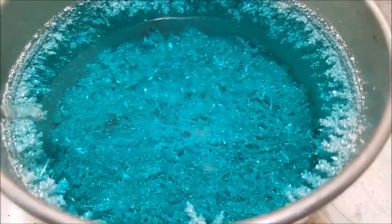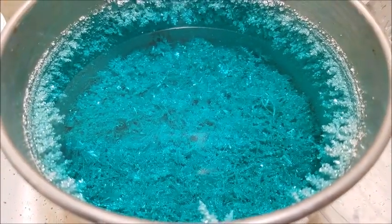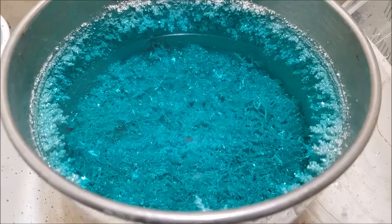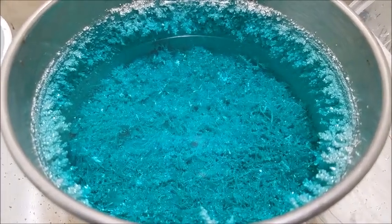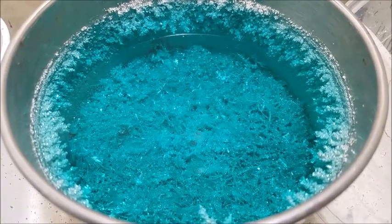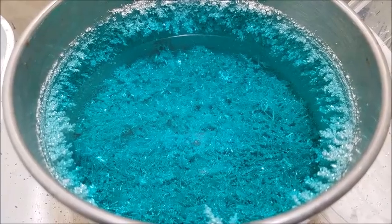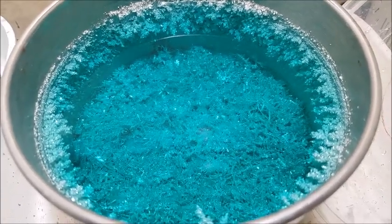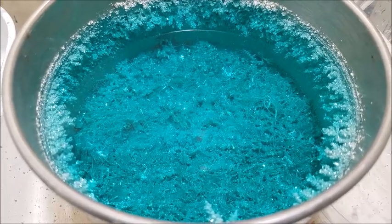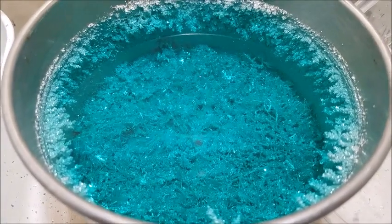We're about 2/3 of the way through our silver shot. And hopefully, the way the color's going, it hasn't severely changed. So I think that we're going to pull it off. I think we're going to get all the way through before this electrolyte is exhausted, and we'll completely run this batch with any luck here, and then when we're done, we'll mix up a fresh electrolyte and run it through one more time.